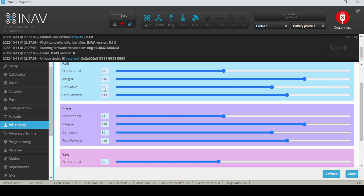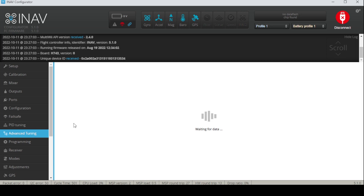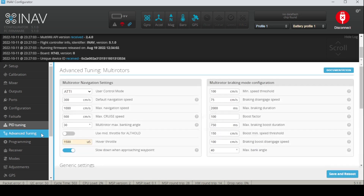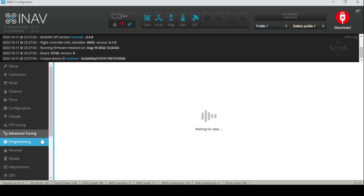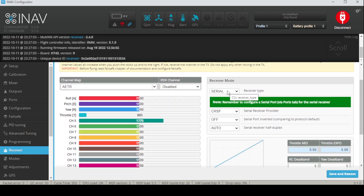I enabled GPS navigation and telemetry output. For current meter I set it to ESC because my ESC has telemetry. As for fail safe, I put return to home. These are my PIDs — this is only conclusive after a quick tuning session. I ramped my PIDs much higher than my 5-inch builds because every time I landed my motors were cool, so I just kept upping by 5 then by 10, and eventually I came to this. It flies my A6300 pretty well so I'll leave it.